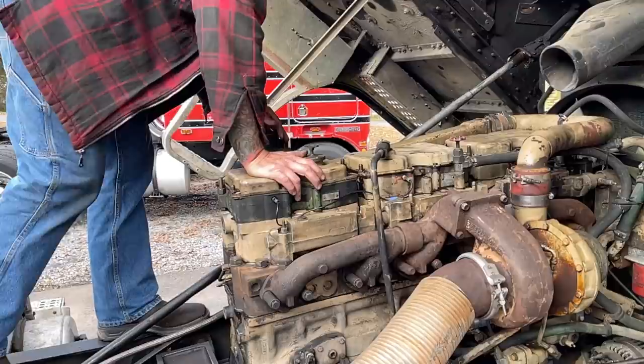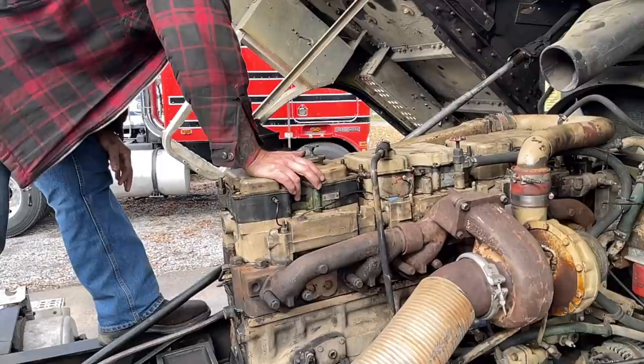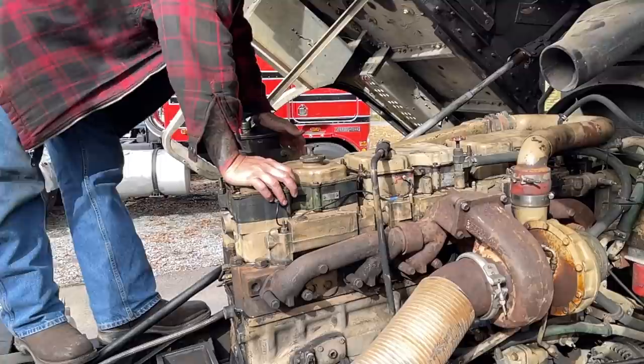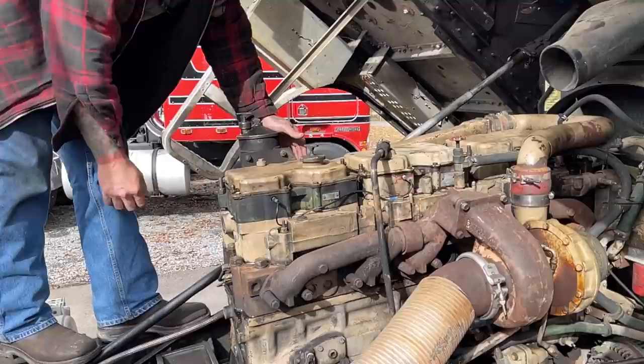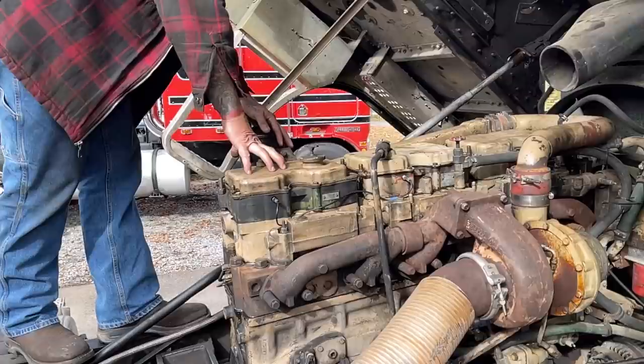So I'm pretty sure it won't be a bad job. We can take the rocker box and valve cover and Jake off without disturbing exhaust or intake or water or any of that. Hopefully that rocker box isn't cracked, but if it is, we'll weld it and let's knock it out. I'll grab some tools and we'll get this thing done. I'll get the valve cover off, and we'll get it to where the rockers are down on this cylinder, so there's not a lot of pressure, and then off and on. Be right back.